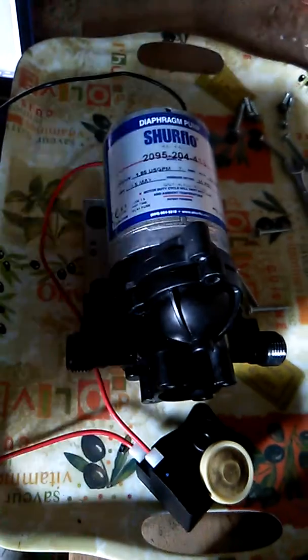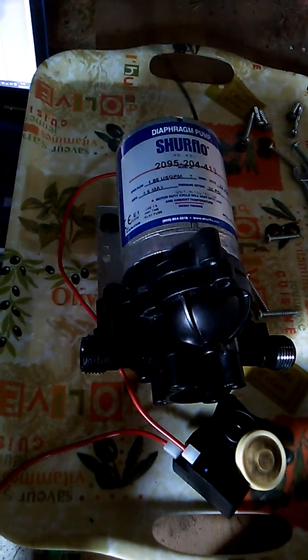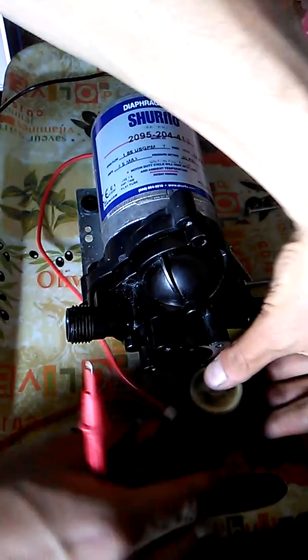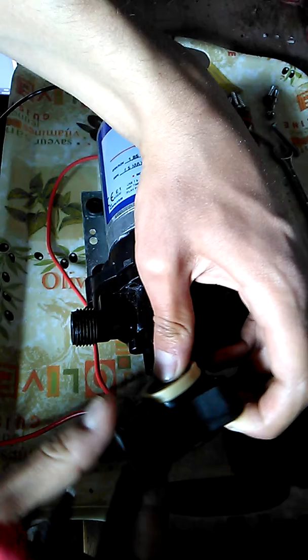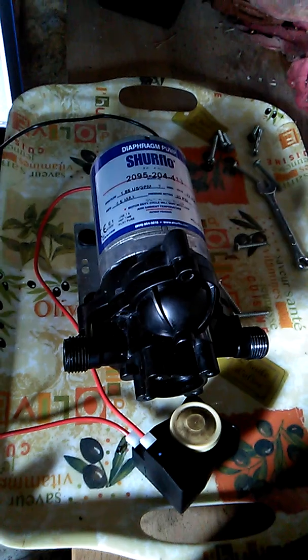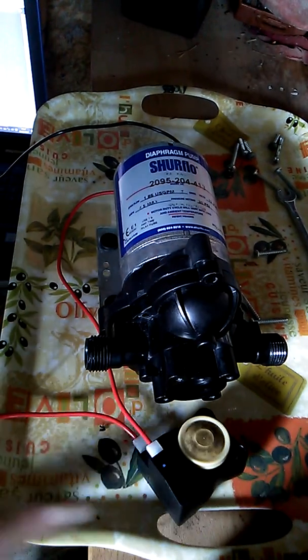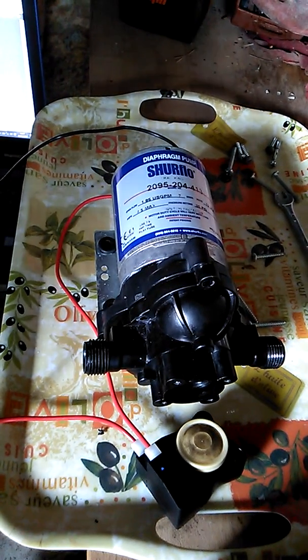We also checked that the voltage between this terminal and the black ground terminal, from the top of the motor, was as expected, much greater than zero, something like 11 or 12 volts, in normal operation. And when you press the switch, and you can do this mechanically yourself, it should turn off that connection, which it did. Our multimeter reading went down to millivolts rather than 12 volts, which is basically zero. So the check switch, I think it's called, was working fine, which meant the motor was working fine. So next step was to look inside the motor.